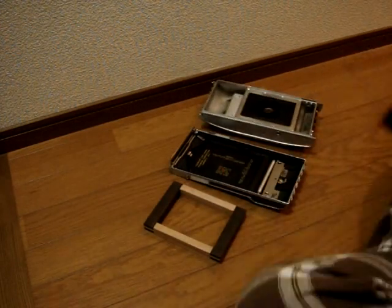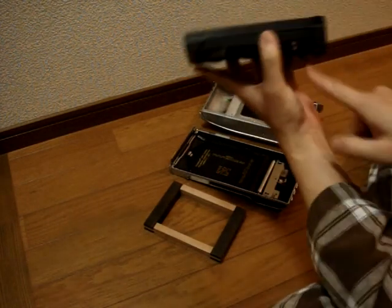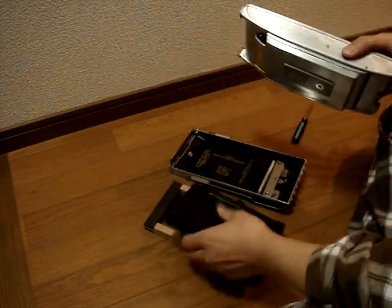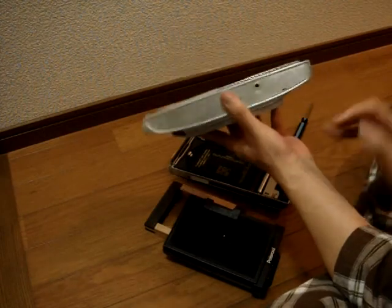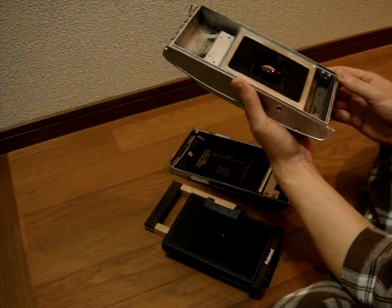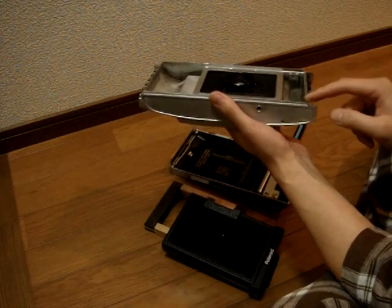I'll get the back. Okay, I'm back here with the back. You can see that the back will mount on here like so. But the problem is the back has this hinge which sticks down. If your spacer is not thick enough to clear this hinge, it will actually stick into the body and interfere here. That's why most people you see on the net just chop this whole chunk off so it clears the hinge. That doesn't look very nice to me, and for my particular camera I don't actually need to do it. But you'll need to figure out a way to accommodate that sticking-out bit — I'd probably suggest carving a chunk out with a Dremel or something, just enough to clear it.